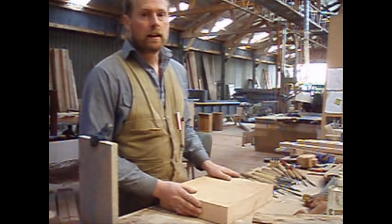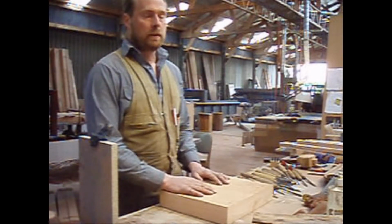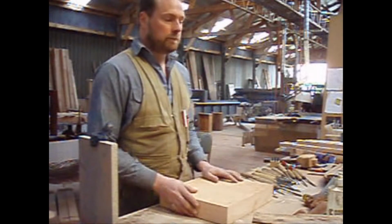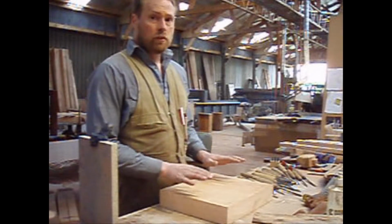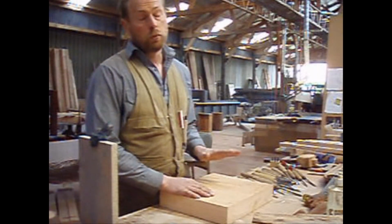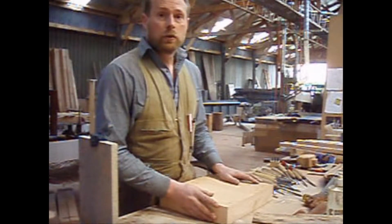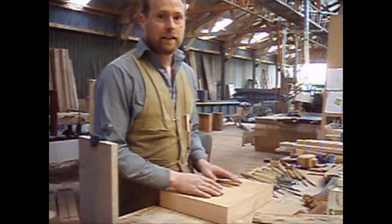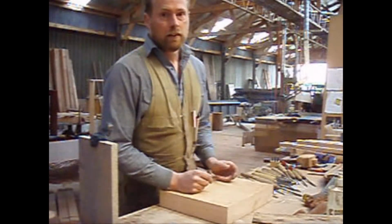One type would be the sculpture type, which is a human form perhaps, or a horse, something that is approached from up to 6 different sides. Then there's your relief carving, which is basically a flat panel that is embossed. To what extent it's embossed, that has different names. Alto Relievo would be where it is embossed so deeply that it is nearly a sculpture that has not quite been severed from its panel.